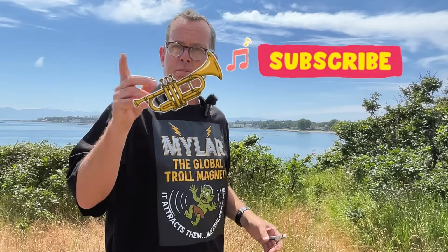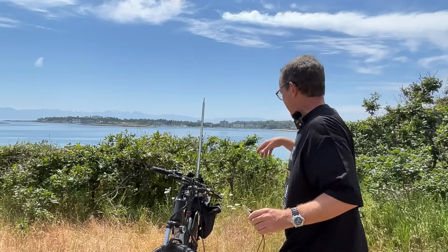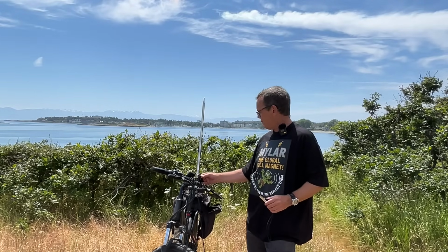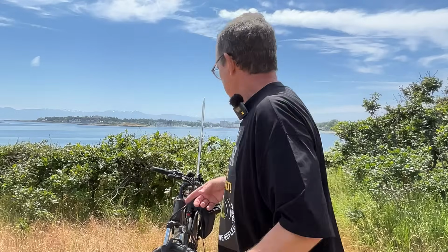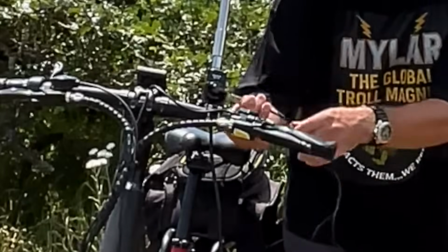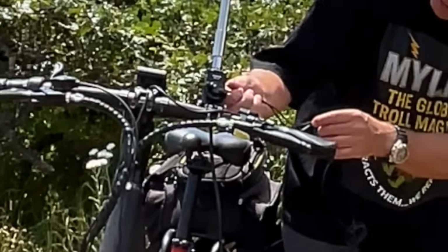So I've decided to go a bit of a different route, and what I'm going to do here is use this big clamp and clamp it straight onto the outer shield of the PL259, just to make sure we get good connectivity, because this little bracket that I've got here on my bicycle, which is made by Nagoya, the Nagoya RB46, and I'll put a link below in the description, guys, looks like it's all enameled and painted, so to get a good ground contact will be very difficult. So what I'm going to do is just clamp that straight onto the outer shield of the PL259.